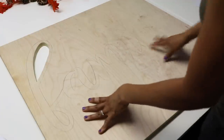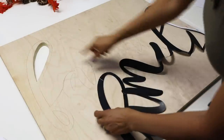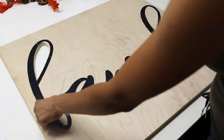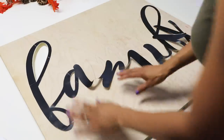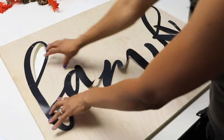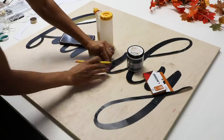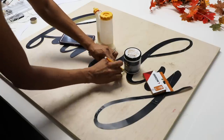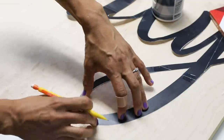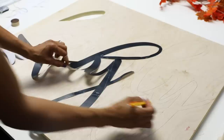For this project, I'm using three-quarter inch birch plywood, which is a furniture grade — it's going to stain really nicely. The size of the plywood you need really depends on the size of the word art that you are doing. Now what you want to do is make sure that you have it straight, as straight as possible. You're not going to want to tape it down or use spray adhesive. If you are putting some stain on it, just put some heavy things on top to hold it in place. Very carefully, we're going to take a mechanical pencil and trace all along the perimeter of the stencil. Because we're using good quality paper, the stencil will hold up and your pencil will give you a nice clean line so you'll be able to cut it out with a jigsaw.